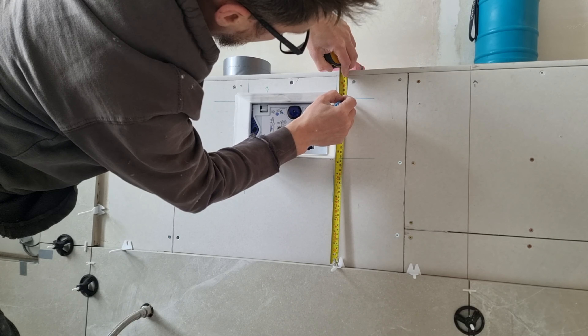Because of the nature of an angled grinder blade, you can see here what doesn't get cut from the front. But as it's the back of the tile, it allows you to go past the box and remove the rest here. I keep going slowly until I can practically see daylight all around.